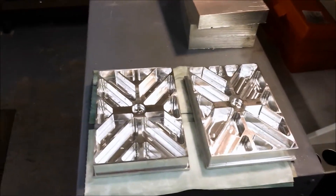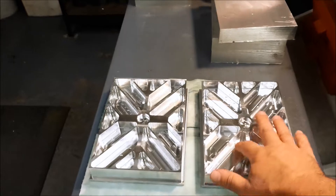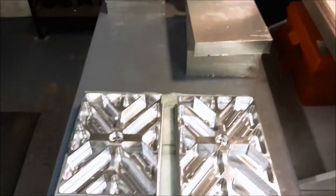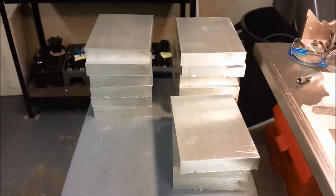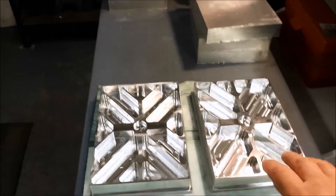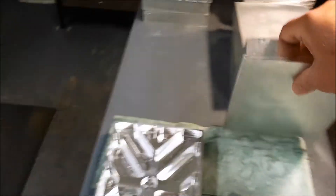And it's taking these clamp-based plates. Right now we're doing the back side. This gets all the material from these pockets, makes it all nice and shiny, nice finish. That's what they look like before we start. Again, this is just the back side. Afterwards, they'll get turned over and they'll go back in the machine, and then we'll machine this side here.